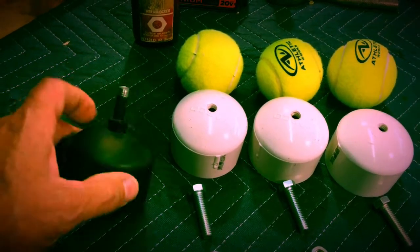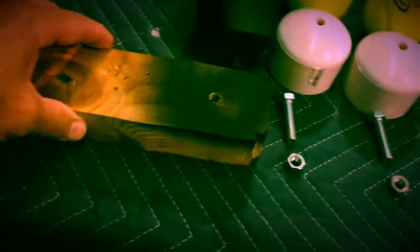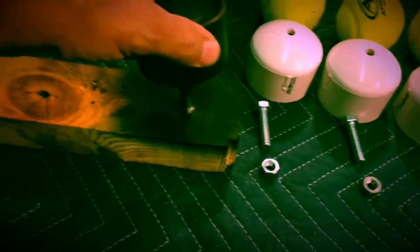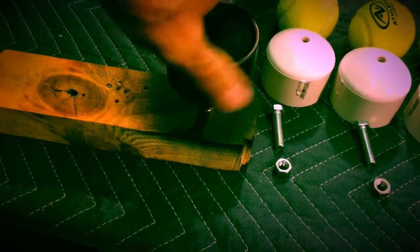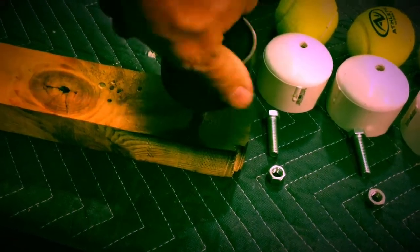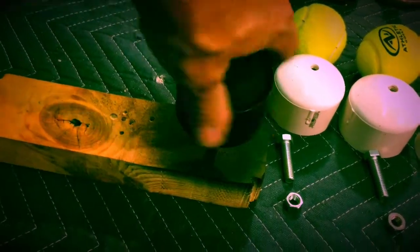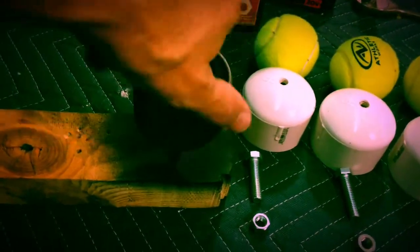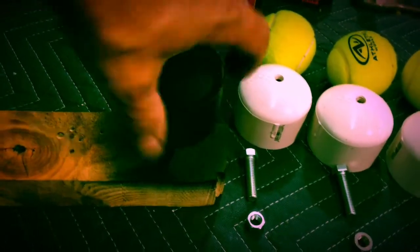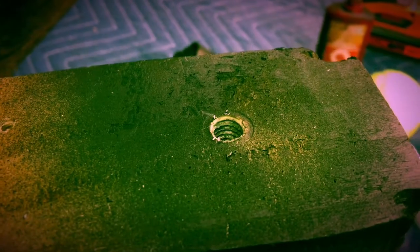I've got a heavy box so we'll see. If you drill a 5/16 hole in wood then that's the perfect size to thread in. You can force it in by hand, but you can cut the threads using the bolt going into whatever you're threading into. That way when it's threaded all the way down you can adjust it back out a little bit if you need to, and that will cut threads right in the wood.